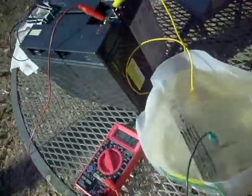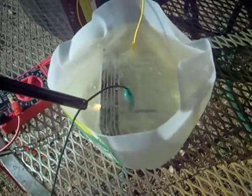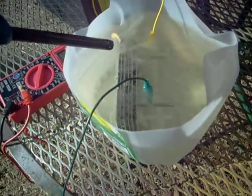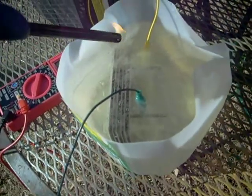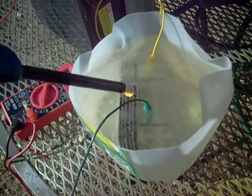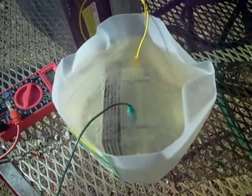Back to the hydroxy gas project — you can see it going to town now. How do I know this is hydroxy gas? Because I can light it. You hear that? That was a good one — that's hydroxy. It's highly explosive because it carries its own oxygen with it, not like acetylene or anything else. It's got its own oxygen — it doesn't need to get oxygen from outside like propane or acetylene.